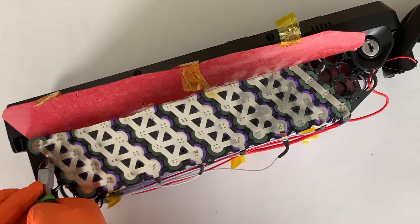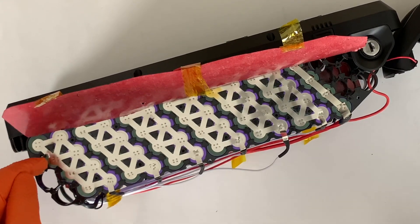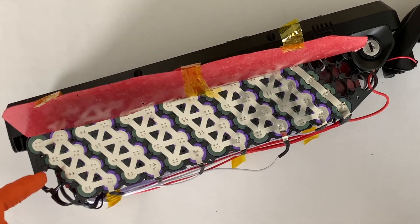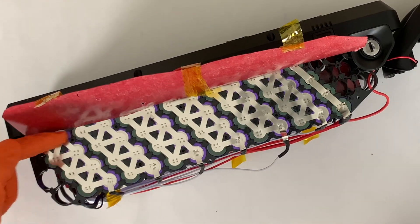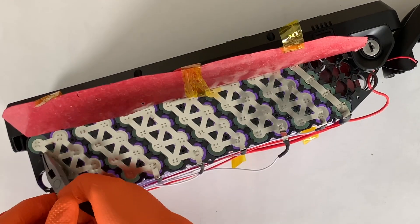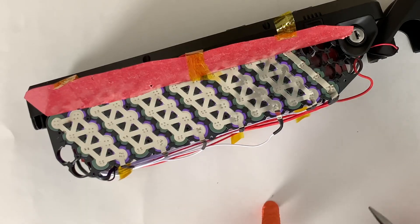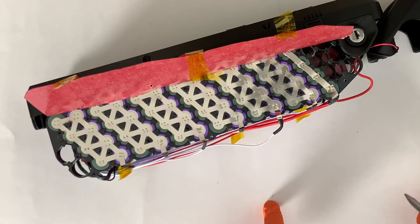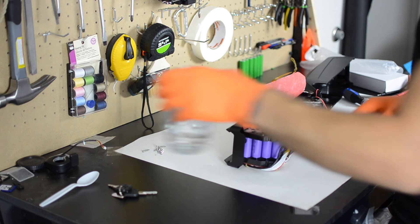What I'm going to do is try and snag a sample from here. I'm pulling a piece off of the parallel connection, because there's very little current flowing along the cell — all of the current is flowing between the series connections. So pulling out this piece will not affect the battery performance at all, but it will give me a piece I can test to determine if this is pure nickel. I've got my little piece of nickel and I'm going to put that in some salt water and let it sit for a few hours.